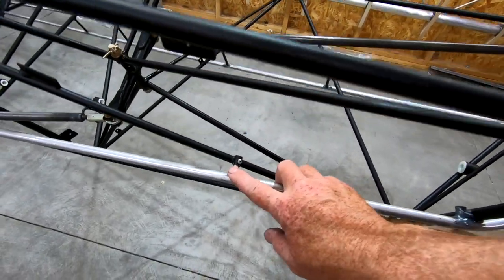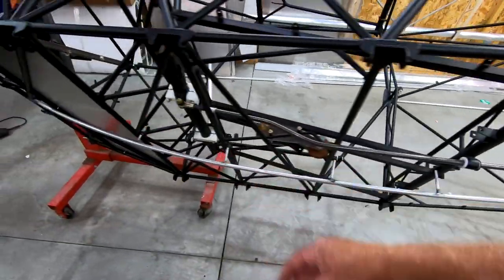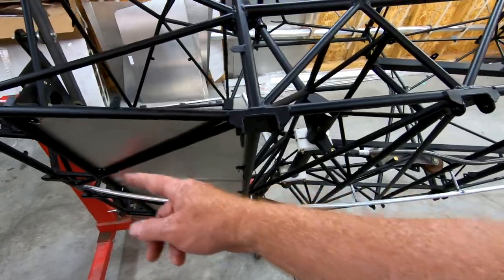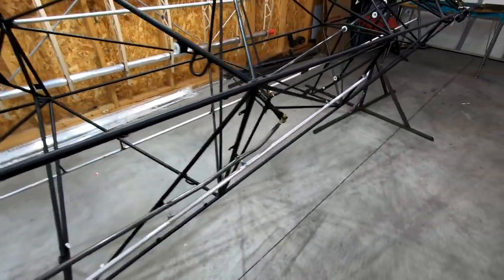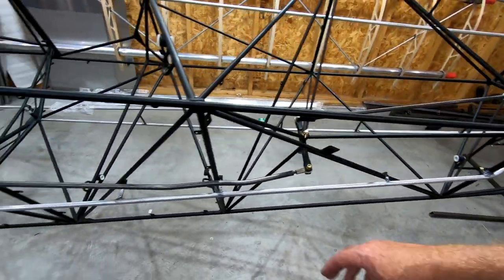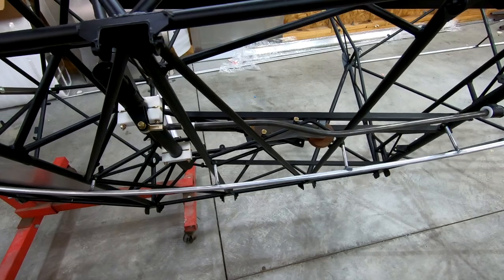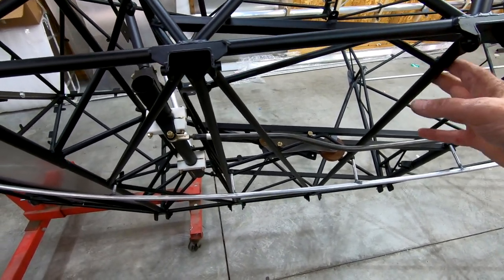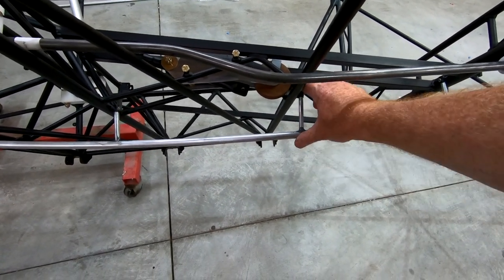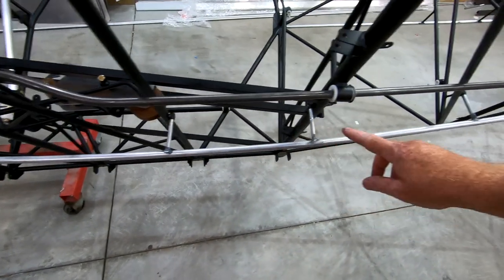You're going to drill and rivet, and you've got to cut each one of these. Where you spend your time is the 36-inch piece of offset stringer aluminum they give you. You put it in your front post, and what I did is I bowed it around and brought it back to the back. I clamped it. Then I went down here, because you've got to have clearance for the flap handle. And it does tell you between 2.5 and 3 inches from the fifth cross member behind the seat. So this was my starting point. I made my offset piece here, clamped it, and then I just started looking, okay, how do I want this to curve?